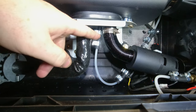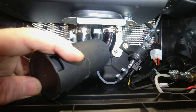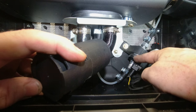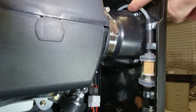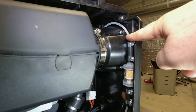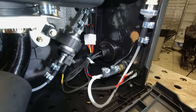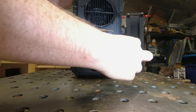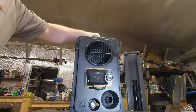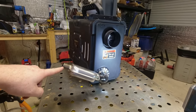I have the fuel line routed from the diesel here to the fuel pump. Yes, the fuel pump is facing downward — that's not really an issue. The bigger thing is having it at an angle so the piston can be lubricated by the diesel fuel. Then I have the fuel line coming up and over the air intake for the heating chamber, and the filter is just wedged right in there and loops around to our input. So when operating, I won't actually have anything hanging out on this side, and I don't need the bracket here because on this side we'll have the muffler.